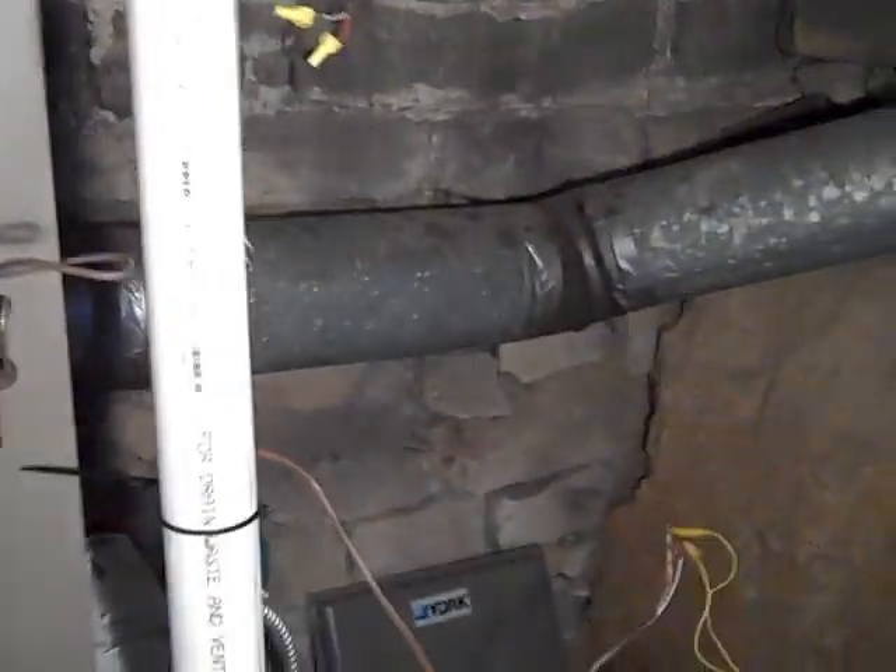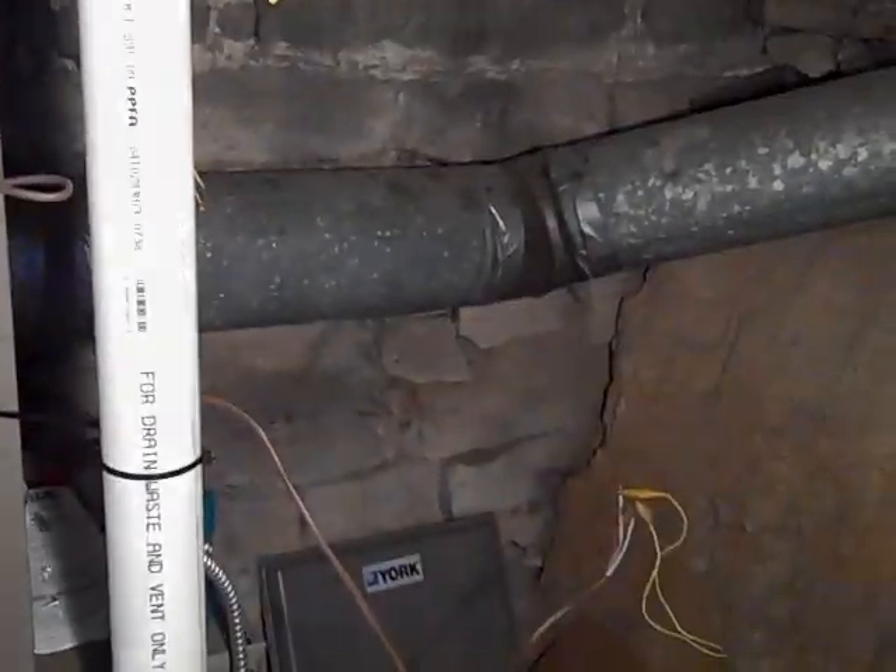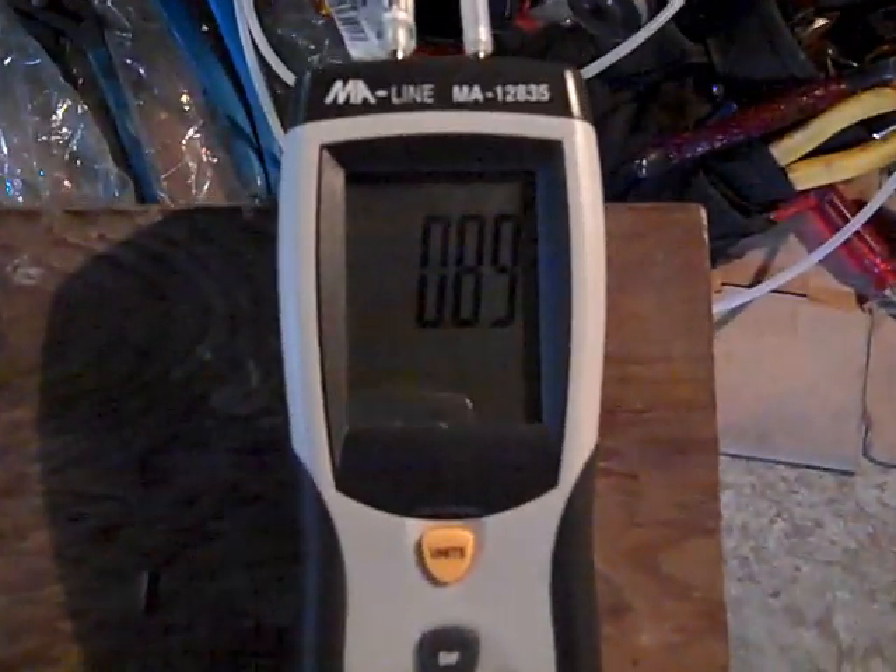So I'll shoot for medium high here and check that. We're on medium high and we've got 0.89 - I'm going to call that 0.9. On medium high, that's 681 CFM.